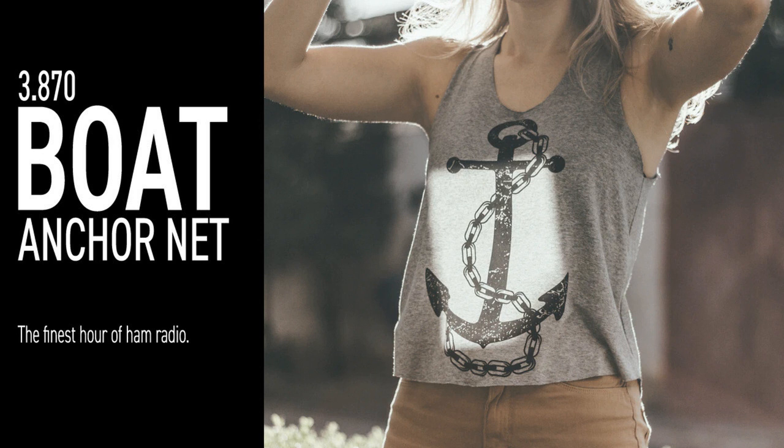This is the best hour of the week here on the Boat Anchor's Net. This is Doug, WB1E, and Brian. I'm talking tonight on a Swan 500. Not doing a ton of power — probably 500 watts, just playing around with the amplifier. Running a couple of 3-500s, but just barely driving them, getting it down to about 40 to maybe 60 watts. The inverted V is at 100 feet. Everybody's sounding really good, and no atmospheric noise — knock on wood. Back to net.